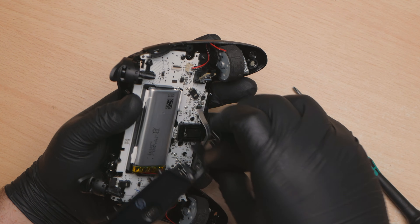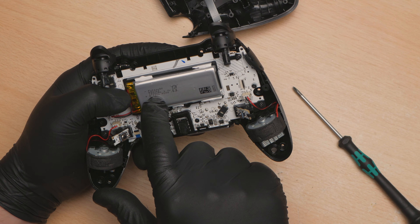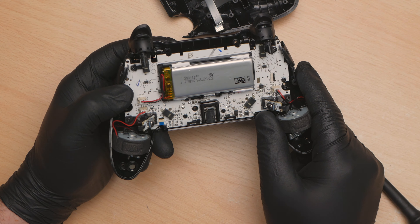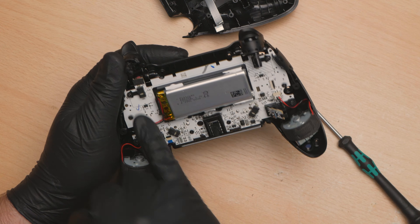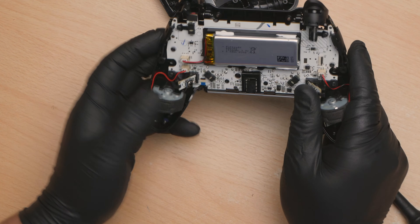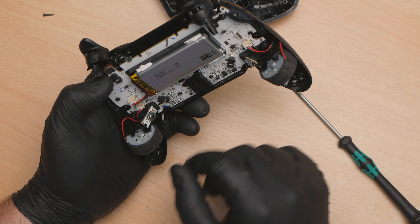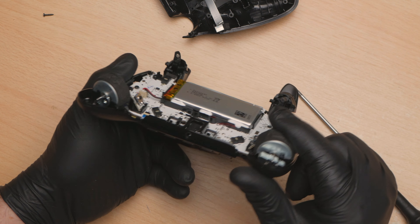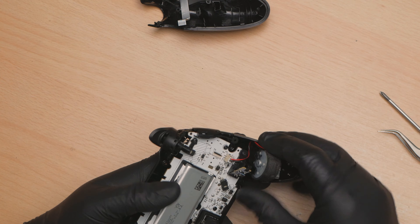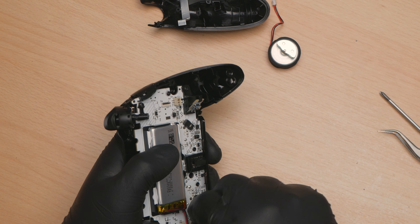Let's undo that. We've got a 1500 mAh battery in there, which is half decent. We've got Omron switches here, here and here, and then the standard Scuf type switches that are in the Reflex - we've got spares of these on our site. The soldering on them is awful by the looks of it. We've got standard rumble motors - we'll get rid of them. At least they're socketed, which is good.